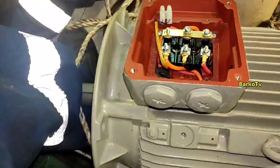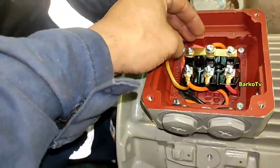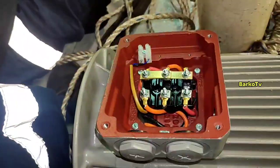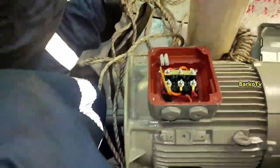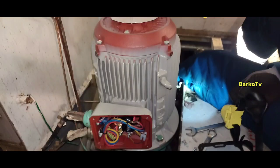We remove the old motor and connect the new one. Then we connect line one, line two, line three at the bottom — that is the very important part. This is the final connection: Y connection at 440 volts, 60 hertz, and there is no space heater for this motor. The company has been informed. I hope you learned from this — please like, share, subscribe, and hit the bell for more updates. Thank you very much.